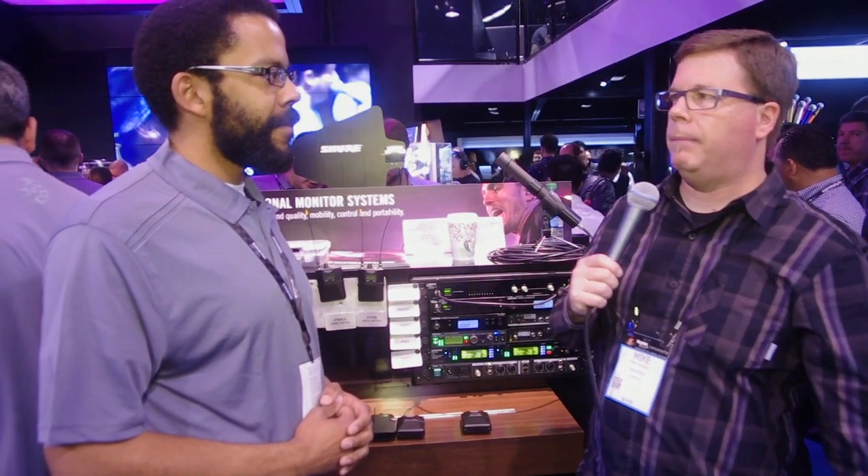I've tested it already and it sounds really, really good. So, the PSM 300 is a stereo personal monitor system. It's replacing the PSM 200, which is an all-analog mono transmission-only in-ear monitor system. One of the great things about the PSM 300 is that we updated the architecture — this is different from the PSM 200, 900, and 1000, which use all-analog components. The PSM 300 has a hybrid architecture that employs a digital audio section and an analog RF section, so you get the best of both worlds: great 24-bit digital audio, super clear, with great stereo separation.